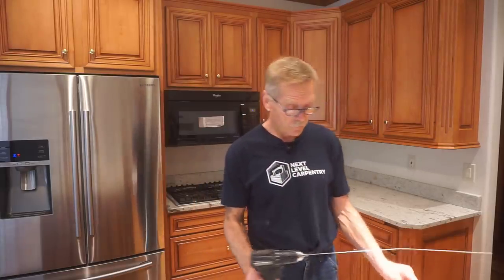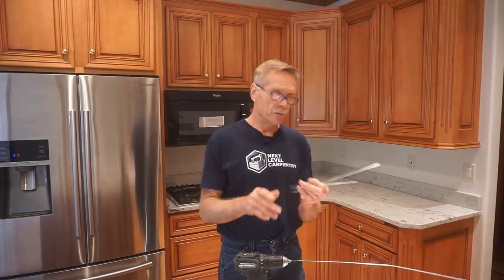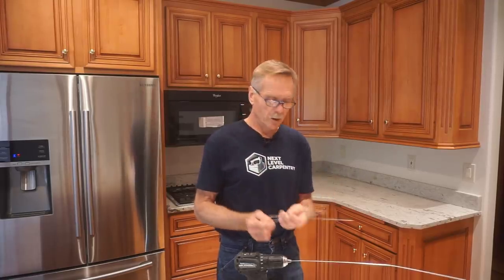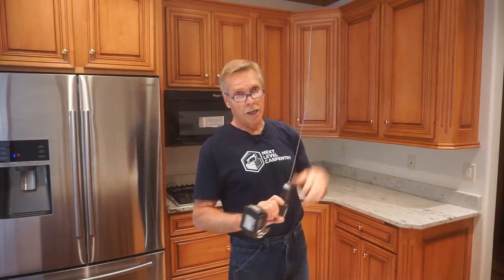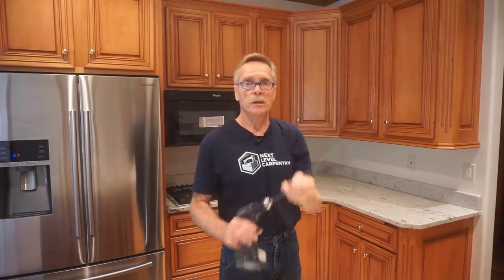When I have to go through a tougher material, I just use shorter pieces of wire, and I carry these three lengths in my toolbox: about eight inches, about twelve, and one close to twenty-four inches. That pretty much covers all the investigations I end up having to do. This extra-long wire is especially useful in attics to locate where a wall is, because the long wire will show up through a deep layer of blown-in insulation.